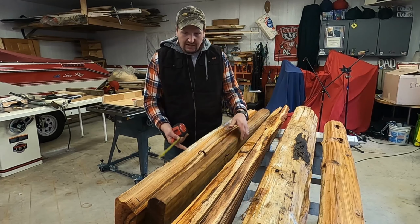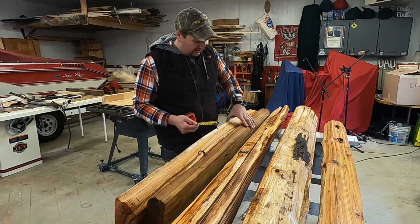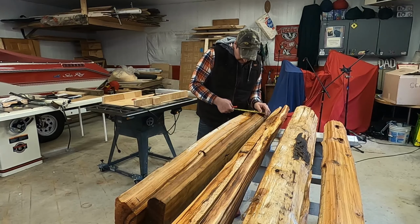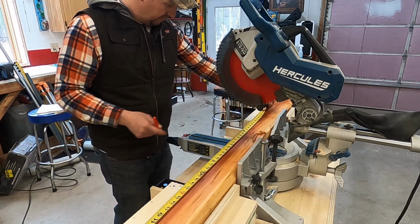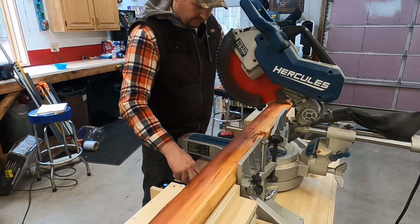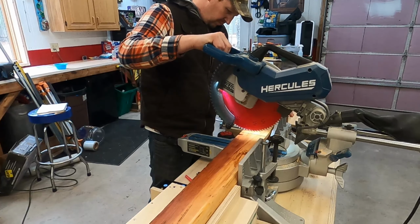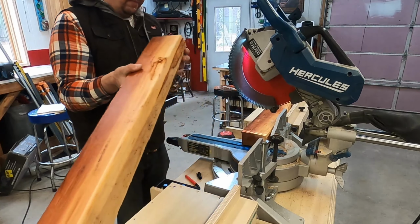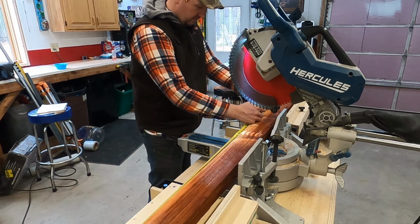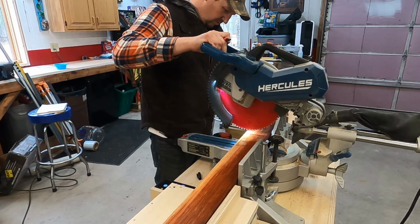The first step of this process is to cut the rails to the appropriate length for a 4 foot wide overall gate. And to figure out what the overall length of the rails needs to be, you need to measure the thickness of the post. And here we get about 8 inches overall, or 4 inches per post approximately. We'll take that thickness and do some calculations against the length of the overall gate, making an assumption for the overall tenon and mortise overlap within the posts and the rails, and come up with an appropriate length of the rails to get the 48-inch gate. And take that number and go over to the chop saw and give it a couple measures and cuts, and we'll make the final cuts to make these rails the appropriate length for a 4 foot gate.